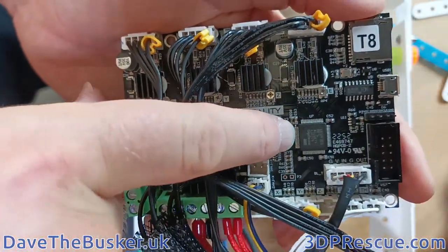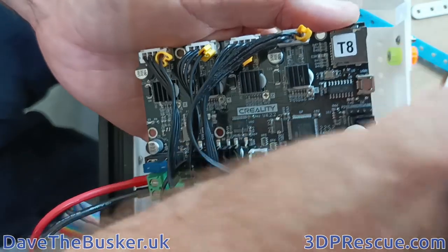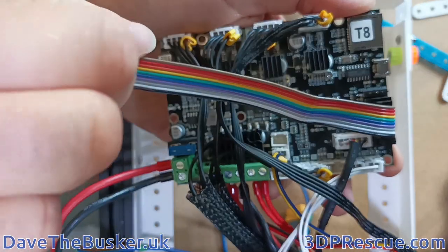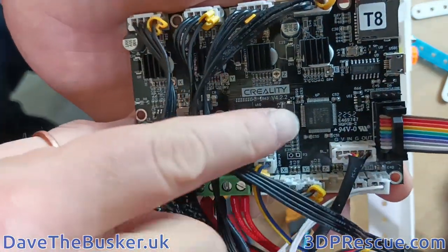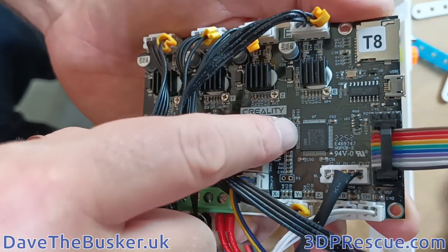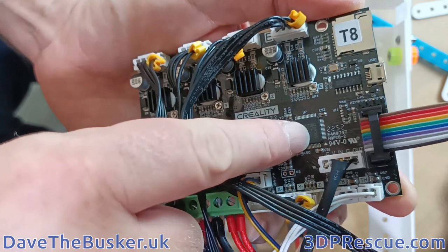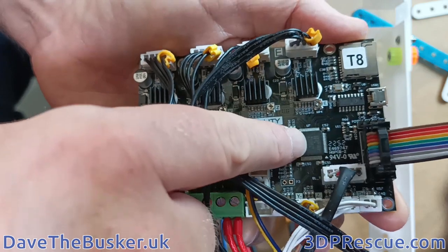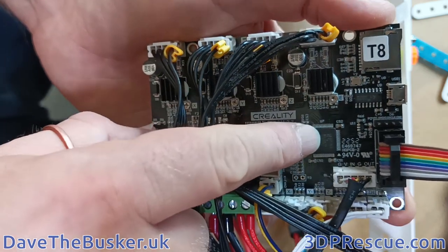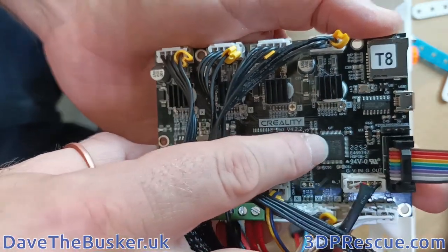This is the chip you're looking for. When your board is all connected up, there will probably be one of these ribbon cables covering it, so you move that out of the way to get a good look at the chip. It probably won't show on camera, but this is a GD chip and it has RET6 on the second line of text, which tells me it's a Giga Device chip with 512k of memory.